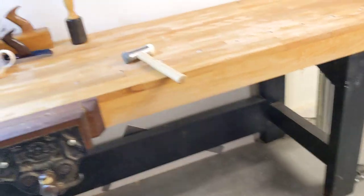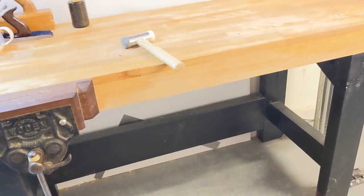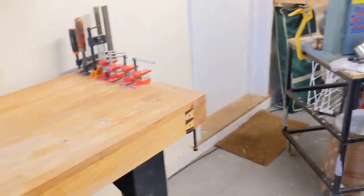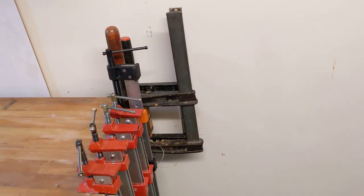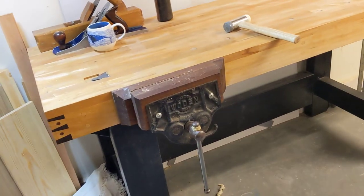My central design goal was to have a tall chest that I could slide underneath, and that's what it was designed around. It's about six feet long and about 36 inches high, which for me is about right, but I might drop it a little. I picked up a cheap bandsaw a little while ago and the working height at that bench is about 34 inches, so I'm thinking about dropping this one so the feed table of the bandsaw matches the bench height — I could use it as an outfeed table. But I might be doing the classic thing of overthinking it.